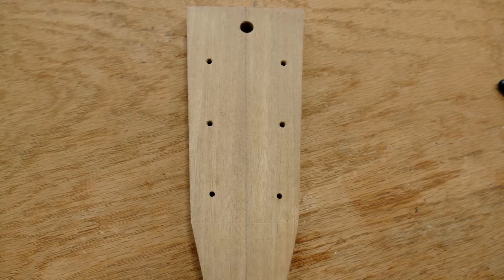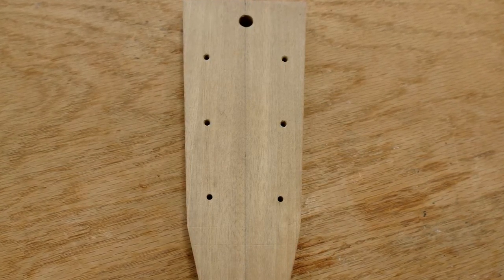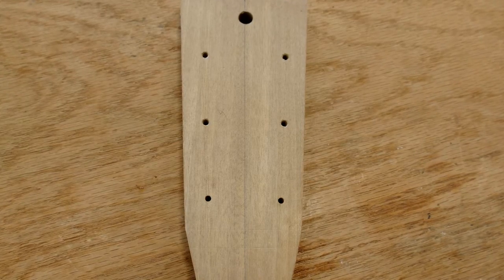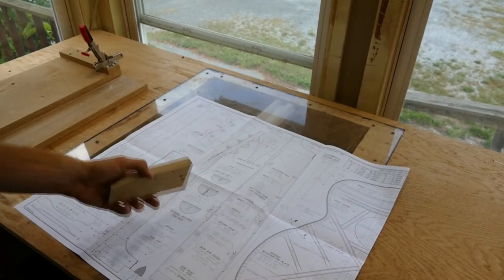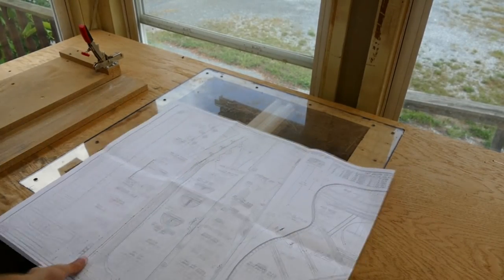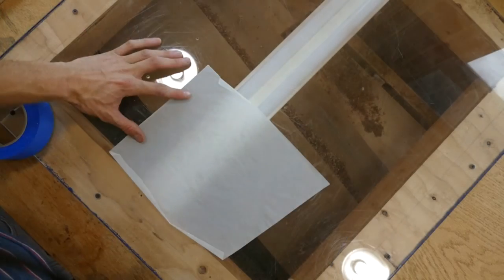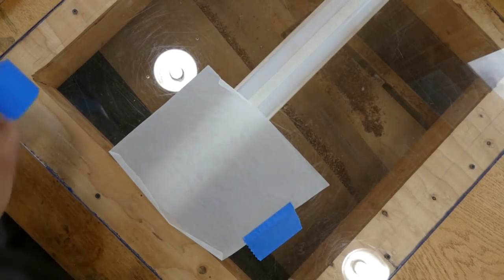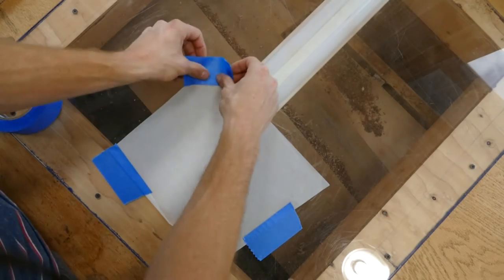Furthermore, the potential for router bit tear out is minimal. As you'll see in a later video, when we route the headstock shape, router bit tear out can be a concern on headstock shapes with long curves and changing grain direction. I will be creating a template with an unconventional design, but again, I recommend that the student either stays true to their plans or creates a simple paddle shape design. On future guitars, the student can rewatch this video and consider taking on a less conventional headstock shape.